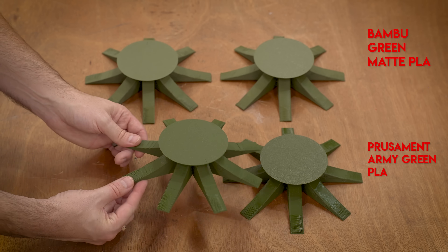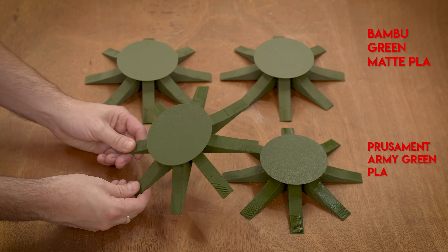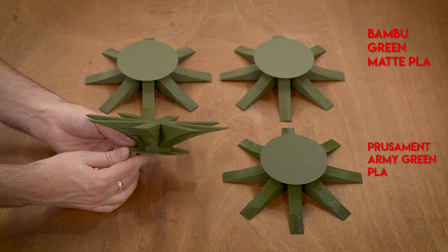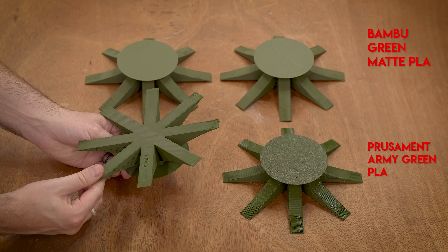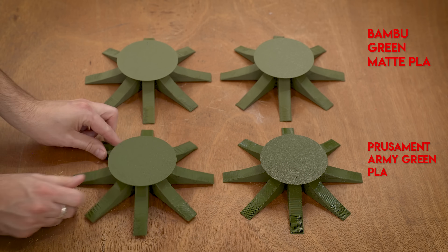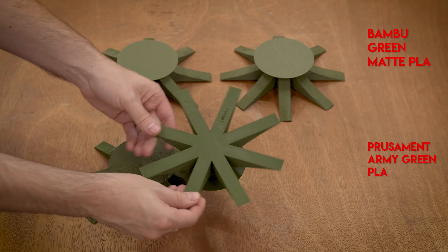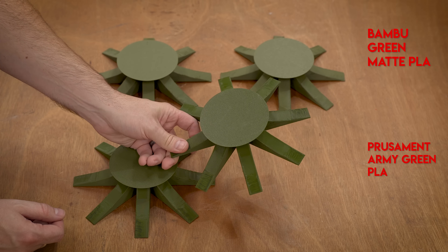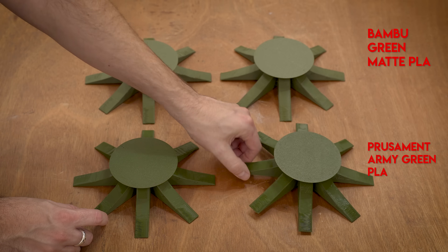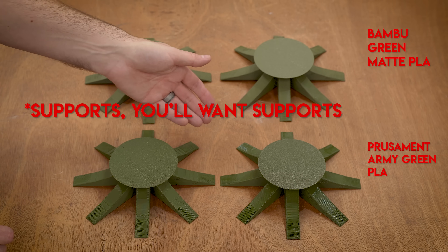This is the first one and it looks fine. There are definitely some issues starting at 70 degrees, lots of issues at 75, but it mostly holds on. The top is pretty rough, there's only a little bit of minor curling on the edges. Overall the top is okay and the bottom is meh. On this second one the top is slightly worse — there's a little bit more rippling and it's a little rougher in general — but the bottom is a little bit better overall. You have better performance at 70 and at 75 it just kind of gets lost, but side by side this one looks overall a little bit better. None of them are great; you're probably going to want to use overhangs.